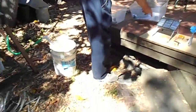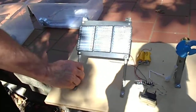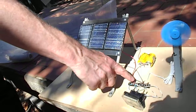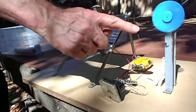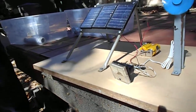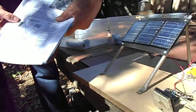We'll show you on the model here what goes into a solar system. We have some solar panels — you need lots of nice sunlight on them, no shading. The solar panel generates electricity from the sun, it goes through a connector box. We don't put batteries in because we're not storing solar energy. Then it goes to run a motor, and the motor runs a pump. It'll pump water at about a gallon and a half a minute, up a distance of about 230 feet or 70 meters.